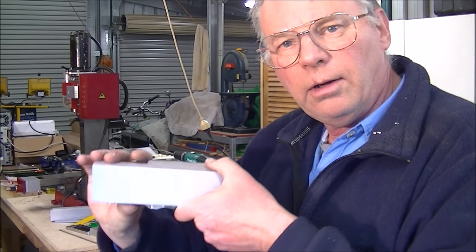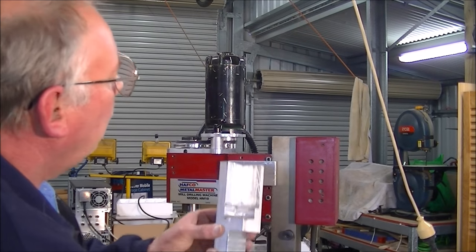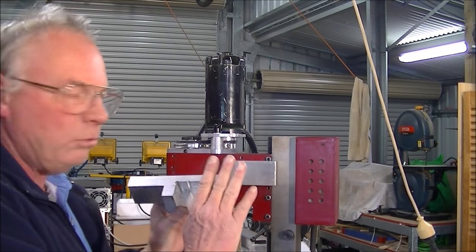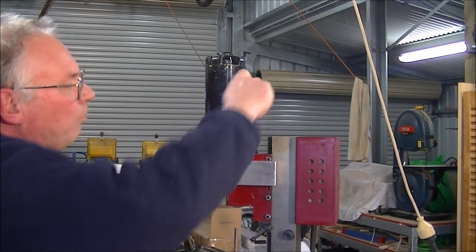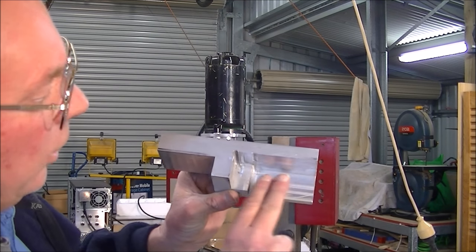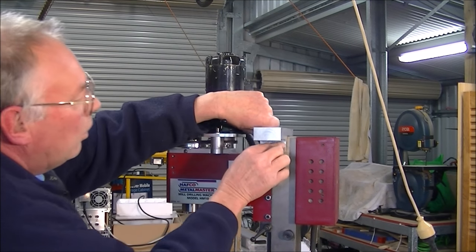We've machined now our main, shall we say, bracketry to support our Z axis. See if it fits. Right, so the way I've machined this, this is where it fits on there like this. You see? So what I've done is I've a good flat contact surface area here, here, and two here. So that's what I was picking up. So this surface here corresponds with this surface here, this surface here corresponds with this surface here, and this surface here corresponds with the surface here, and it fits perfectly there, like so. All nice, square and flat.